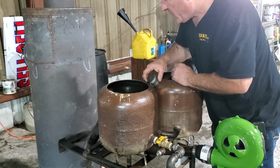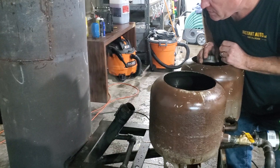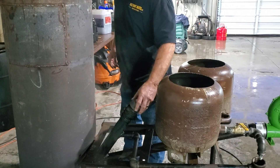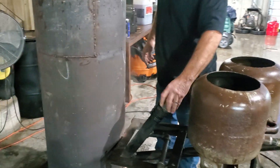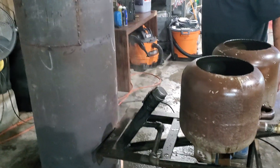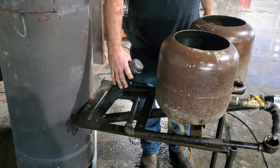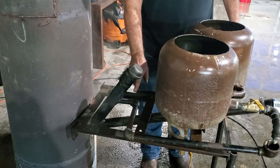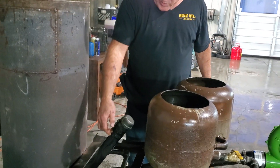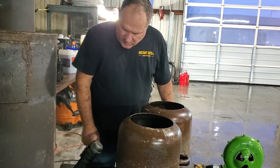When I add this cap on there, it's actually going to make more air go down inside. This part right here is not welded — it should be welded so it's air and water tight. Right now it's just leaking out of the fan connection and I've got to weld this up. I've got just the nipple width right on there, and eventually I'm going to weld that up and you won't have that smoke. But that'll go away in a minute.